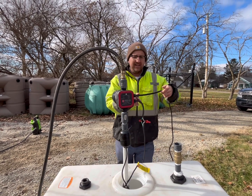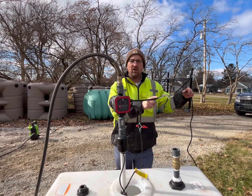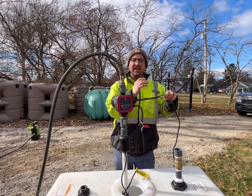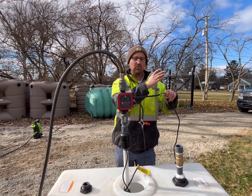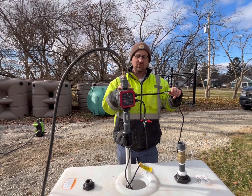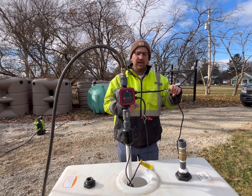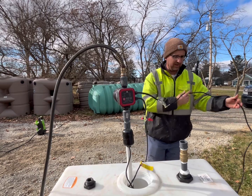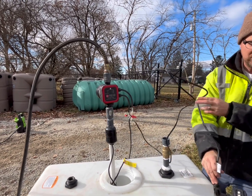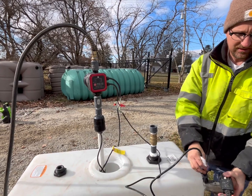On the top side, this is what will usually run into a junction box and then directly into a home run into your breaker panel. So you can have a dedicated circuit feeding this controller, then feeding the pump. In this case, we just wired in a standard cord that we have plugged into a three-way splitter.